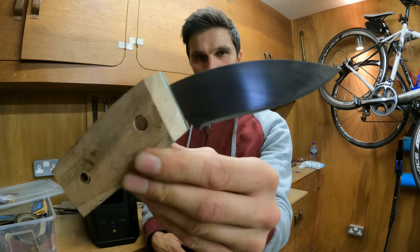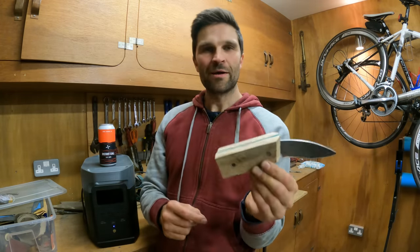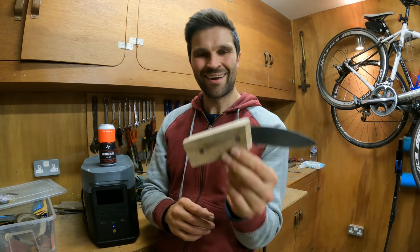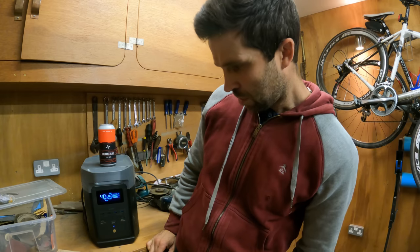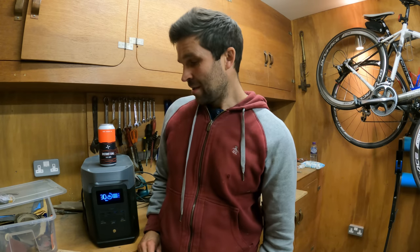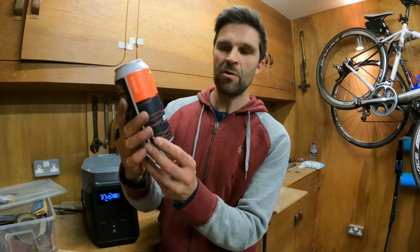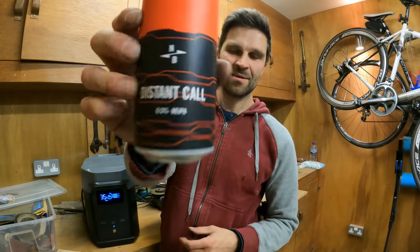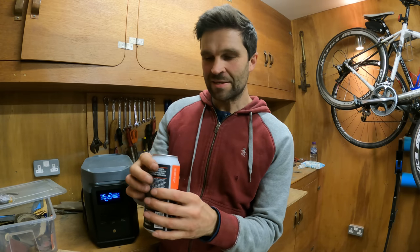We are ready to dry-fit it. We've got all the components: starting with the blade, pop this scale onto one side, drop the solid pin through the front, bring this scale on, line those holes up, then drop the tube pin at the back where the lanyard is going to fit through. It dry-fits pretty well. I need to clamp it without anything falling out. I've got one clamp on and the pins are just below the surface of the oak so you can clamp over the top. I'll glue it up with flat pieces of wood either side and leave it overnight. Looking pretty good — getting there. We're at 66% on the power station, so plenty of energy left to sand and shape it tomorrow.